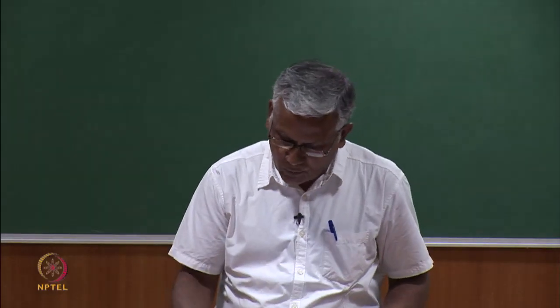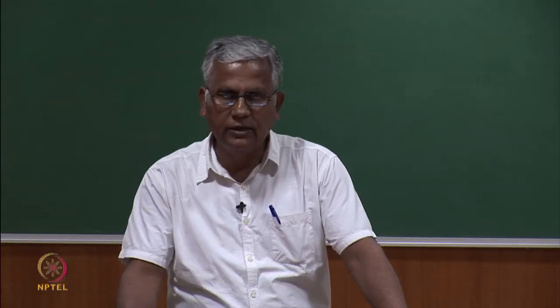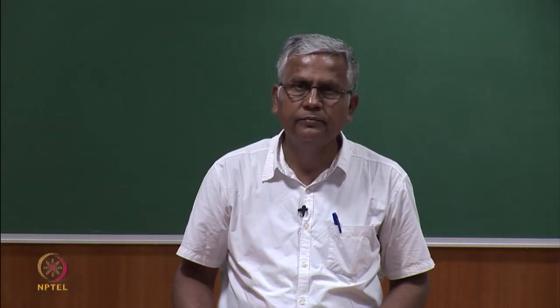On the draw frame, if processing cotton or viscose, certain humidity and temperature are needed; if processing synthetic fibers like 100% polyester, acrylic, or nylon blends, different humidity and temperature are required. Too low humidity can cause static generation leading to lapping and stoppages; too high humidity means fibers keep absorbing moisture and stick to machine parts. Too low humidity also means low cohesion between fibers and a lot of fluff, especially with hygroscopic fibers like cotton or viscose.